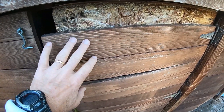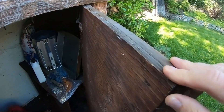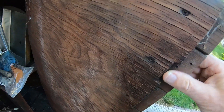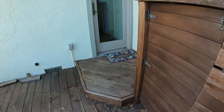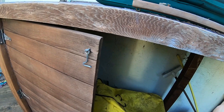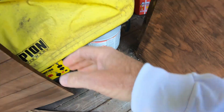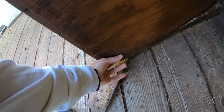To make these doors, I didn't want to have a bunch of screw holes come in here. So what I did — I'll show you on the one that's still pretty good — I used some half-inch indoor outdoor plywood as a backing and I glued these boards to it, then screwed from the back with little short screws to keep them in place. This set of doors is fine, but for some reason this door got more water or something, so it just rotted out on top. The redwood is basically okay, but the half-inch plywood rotted finally — pretty much all the way down the side and on the bottom.